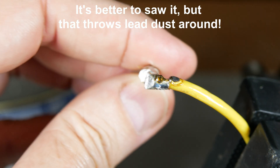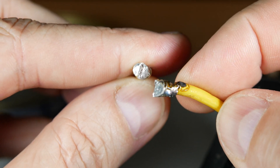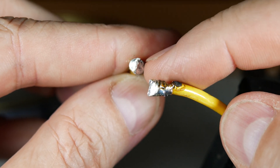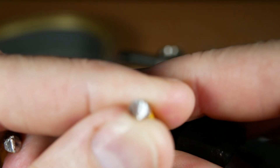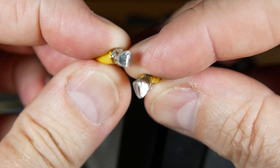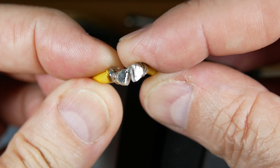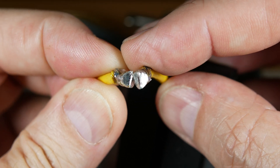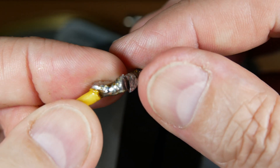Let's see if we can hold this in focus. As you can see, there are no voids, no gaps. It is clean all the way through. So if you're doing low-voltage outdoor lighting or burying wires for your drip system or something like that, this joint would work.